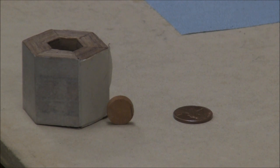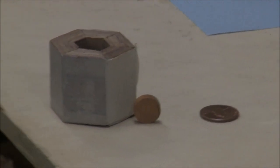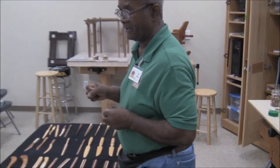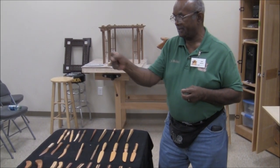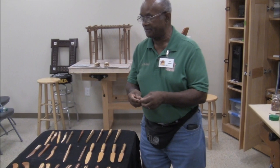In other words, if my saw is level, I should be able to pull it out and the saw will sit right there and turn, and not just run right out in the wood. If you have to hold it back as much as you're pulling it, you need to check your blade. You might get a little different cut.